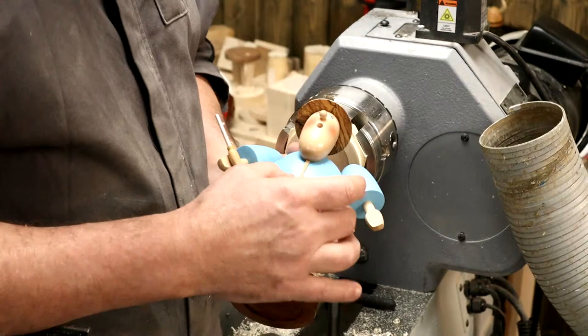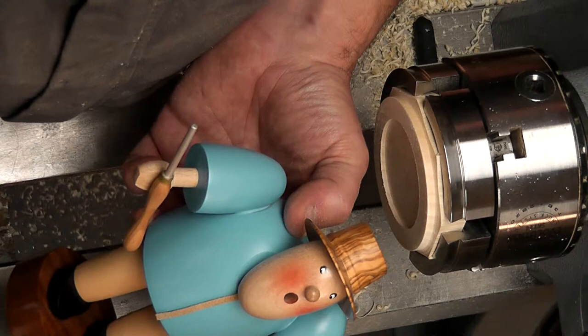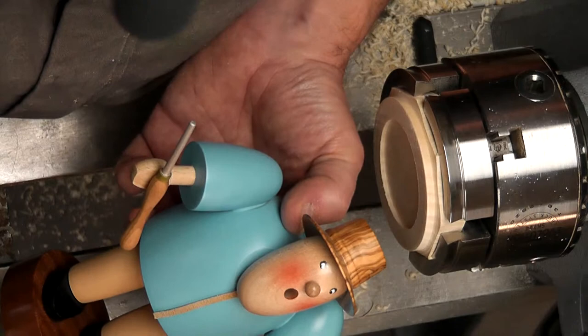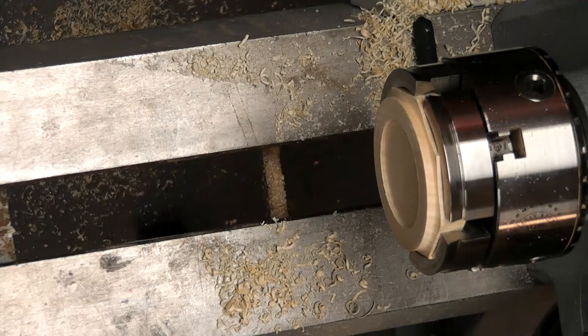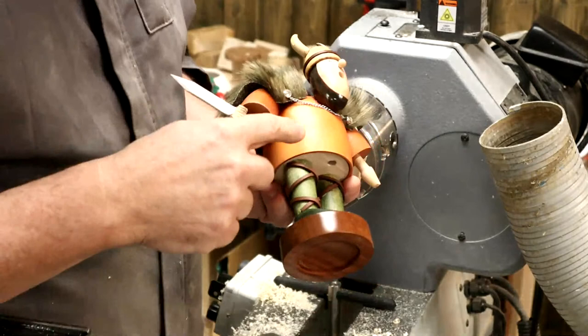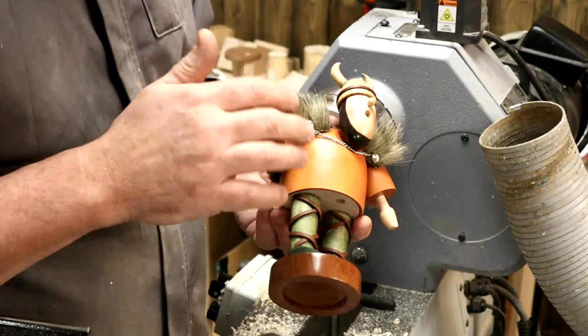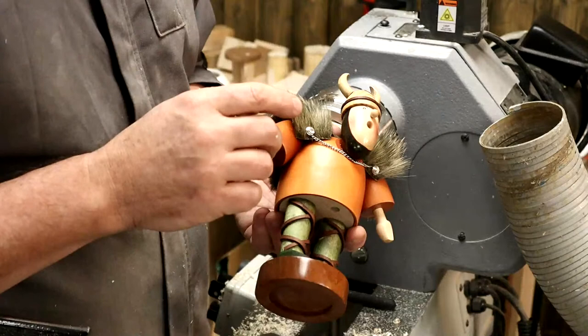But if you look at the rest of the clothes, the trouser here, the shoes, and even the smock, they're with an opaque paint. So I've used a spray paint. I've used Cobra graffiti art paints. They're really good aerosol. They're a single cover. They've such depth in their pigment that they work really, really well. But if you want to go transparent, then you don't sanding seal. Transparent colors will basically mean wood dye or spirit stains. Now, I use two. I use the chestnut spirit stains or the Chromacraft wood dyes, and I don't put a sanding sealer on first. You put the color straight onto the timber, and then you seal over the top of the color. You may find you have to denib a little bit, but what I tend to do is put the dye on, then a coat of lacquer, and then denib, and then put another coat of lacquer on. I find that works really, really well.